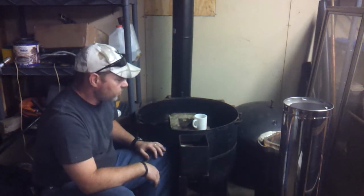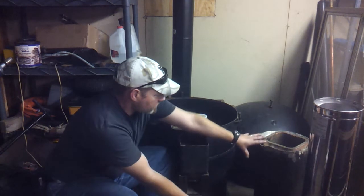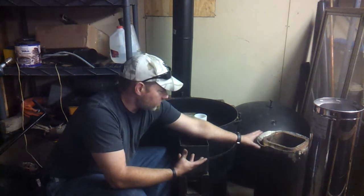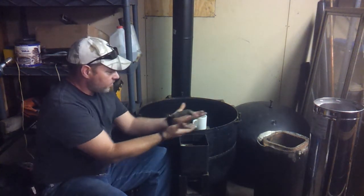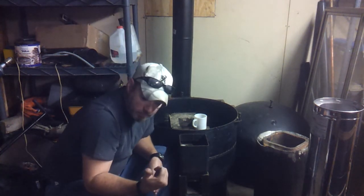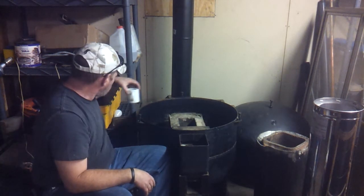During the move the heater was jostled around, put on a hand truck and tipped around a little bit. What happened is the riser — it's upside down right now, it'll go on like so — but the insulation, whether it's perlite or vermiculite, the furnace cement cracked and broke. These pieces here sealed the bottom of it and it all fell down inside. I've got a three cubic foot bag of vermiculite and I'm going to repack that riser, insulate it, put furnace cement on it, and get it reinstalled.